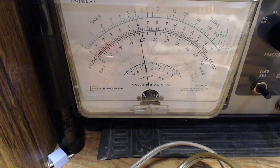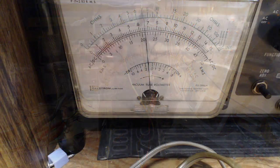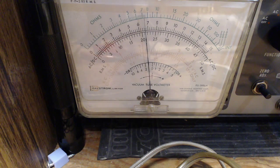But chances are the radio's sensitivity, if you like, really hasn't changed. I've just moved the IF resonant point of the IF transformers to where it should be. So the next thing on the list is to do the... Yeah, better read up here. Before I do that, I just realized I had the radio on restricted power, not on full power. Now I've got to double check those. They're not likely to be a problem at all. Okay, just doing it in reverse order now. I just squeaked a bit more out of that one.